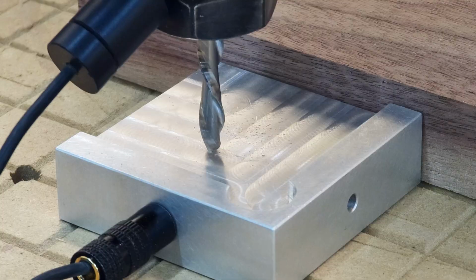And that's where Vcarve comes in. Now we could make a whole video about Vcarve Pro and how it's leveled up our business, but this one trick has changed our entire process. That's right, we now probe from the machine bed itself. Vcarve will measure from the spoil board itself upwards, so the bit will never go lower than it.